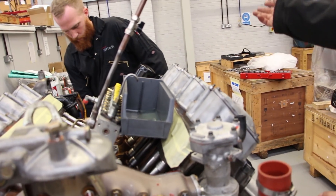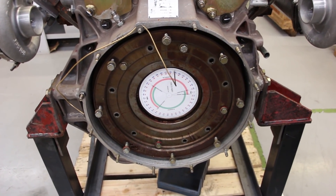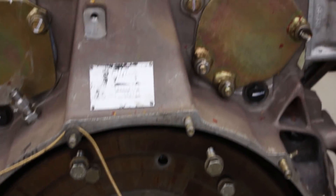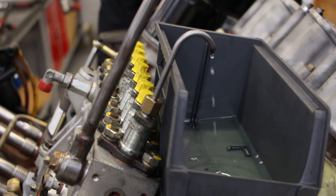Kelvin will now bar the engine right back — you can see we're going to bring it more than required before TDC. With the pump in full fuel, the delivery valve is removed, with the spill pipe on the top.